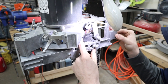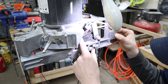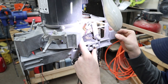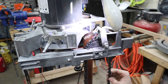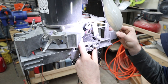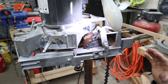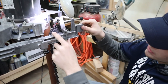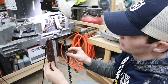When a lot of people do round grind and steepen up the angle to make it a lot sharper at the tip, they give up a lot of durability. A 30-degree square grind would be roughly equivalent to a 40-degree round grind in terms of performance. You get a lot more durability out of the square grind because it's more proficient in the wood at a more blunt angle. The reason it lasts better is that instead of having a typical beak, you have those two faces meeting at a corner — you have the support of both the side plate and the top plate, which makes it a lot more durable.